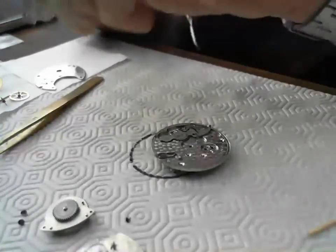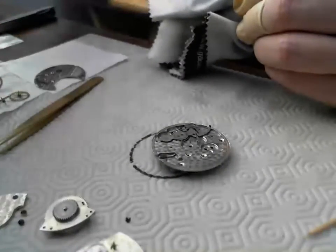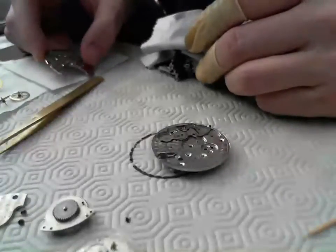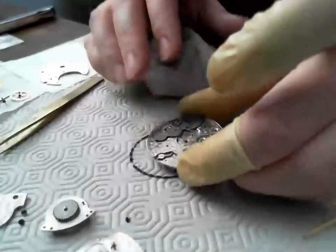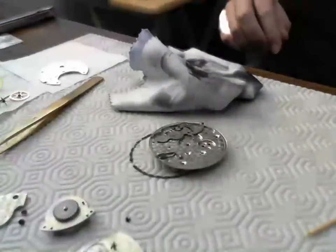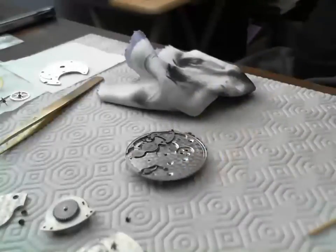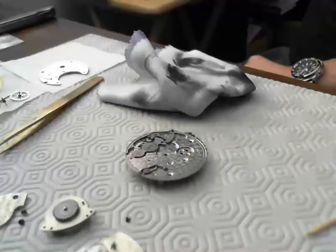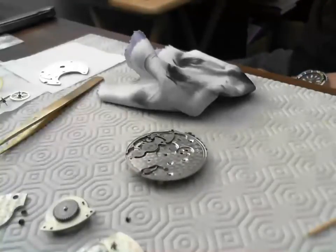So that's nice and clean. I'll put this back where the screws are and move the lighter fluid out of the way a bit, and then I can put this one back as well. But I'm probably going to have to take a really close look at these jewels to make sure, because I think they're capped, which gives them 21. That's a pain in the arse, as they say, but an evil necessity to oil them.